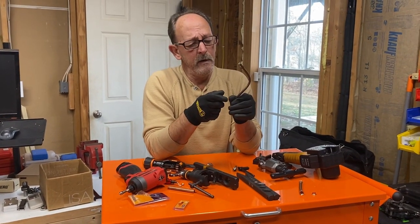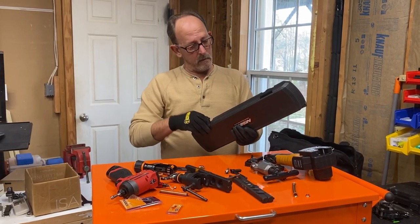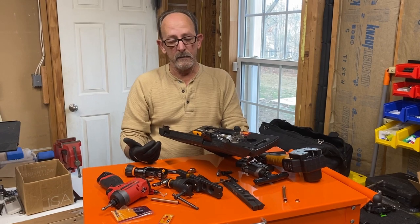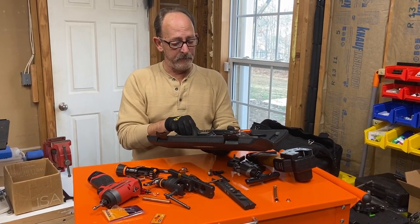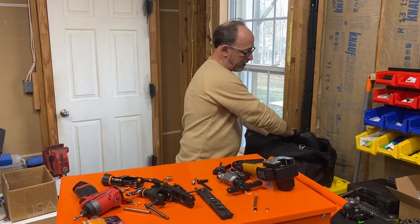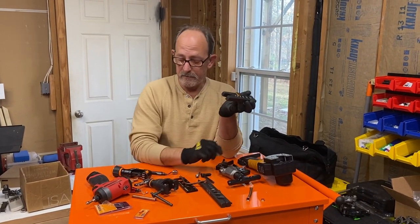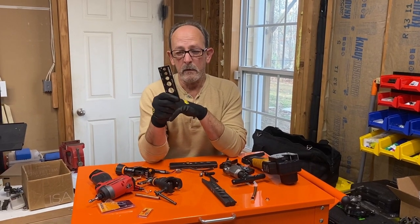So there you go. And then of course, when you get done with that, you want to use a torque wrench. The reason we use a torque wrench is because not everybody's 10 pounds of torque is going to be the same, or 30 pounds of torque, or whatever the flare nut calls for. So always make sure you use a torque wrench, because with the price of R-410A nowadays and the cost of labor, this tool right here is going to pay for itself. And then always have something like this as a backup, just in case something happens to this tool. But it doesn't matter which one of these you have, that's the most important tool.